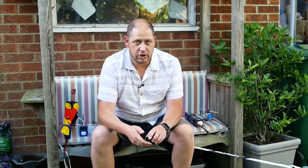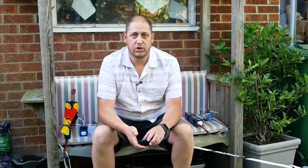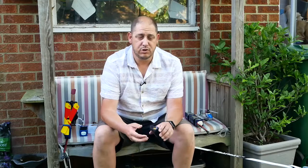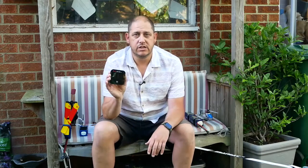The only way I can prove that is that I had a graphene battery which I used in a quadcopter and basically caned it to nothing. When I put it on the tester it said 0% left in the battery. Normally if you put a battery that dead on the charger it won't charge it. There are ways around that — you can trick it into thinking it's a NiMH and stick some amperage in to get the voltage up. But you stick it on this, it just starts putting voltage in — no amps to start with. Once the voltage of the pack picks up, it then starts putting amps in, and it did it all on its own. That is fantastic.